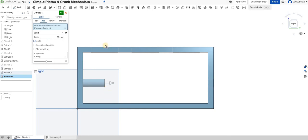You can see where these holes are, so we know that if we put 50mm into this extrude that is bang in the middle of the hole where the piston is going to fit. We're going to take that back to 30 millimeters, and that will give us space to build the attachment. In fact, if we take that back even further to 20, that's still going to be absolutely perfect.